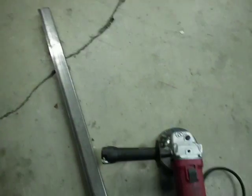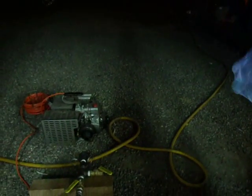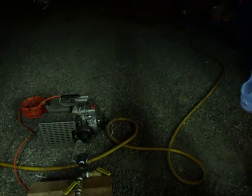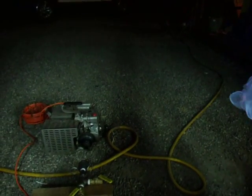This generator is rated at 1,000 peak watts, probably 750 normal watts. So we're going to put a 600-watt draw on it and see what happens — that's probably around 80 to 90% of the generator's capacity. We'll see if it'll keep up on wood gas.